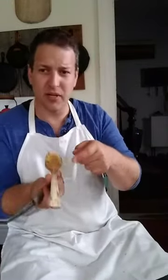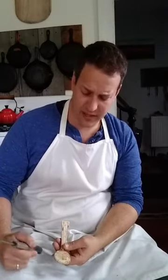So now on the handle, I'm going to do the handle on the second stage, right? I've got my pencil line. And notice how my pencil line is a little sketchy. You can see down there, I sort of tried out a couple different lines. So I'm not trying to hit that perfect mark right off the get, and keeping the side of my hand braced on my leg, and then limiting my pencil motion to whatever the arc of my hand could be, really allowed me to end up with this nice consistent shape.